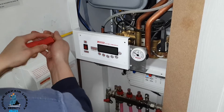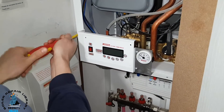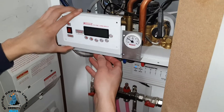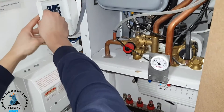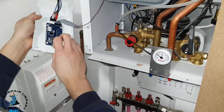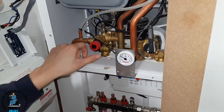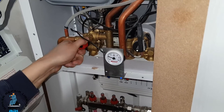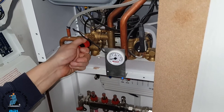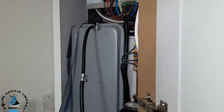We need to get this out of the way — removing these two screws on the side. Put that to one side. Now I'm going to open the PRV to let the pressure out of the boiler.